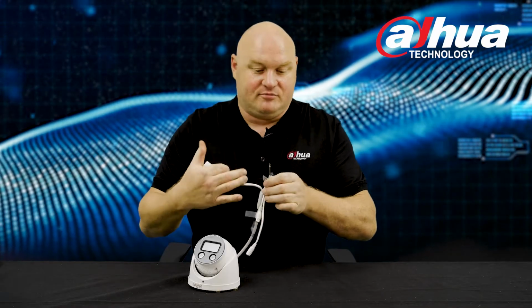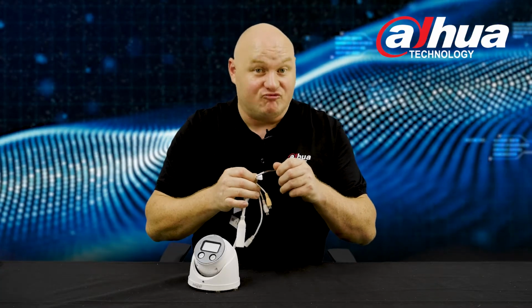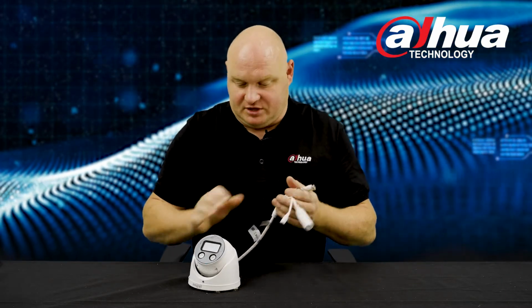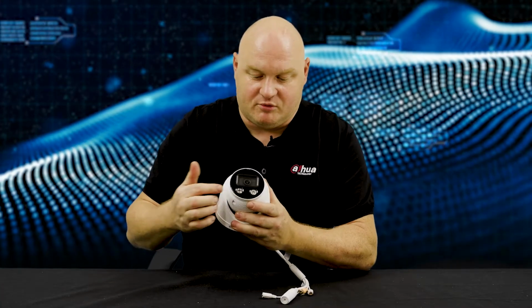We also have alarm input and output, so of course we also have a 12 volt, 1 amp electrical tolerant relay in the camera, as well as audio in and out. Whenever it comes to the camera itself, first of all up in here we have the speaker for the TiOC 2 camera, and on the front we will notice that we have the dual illuminators.